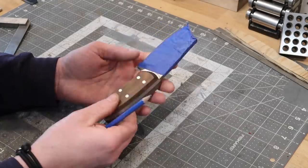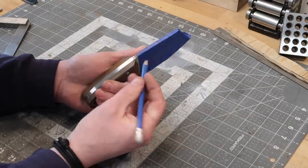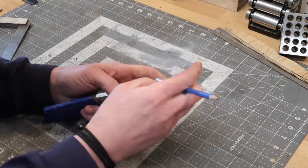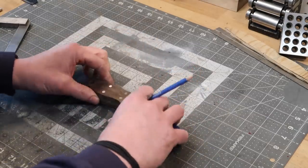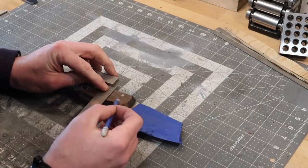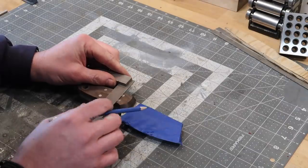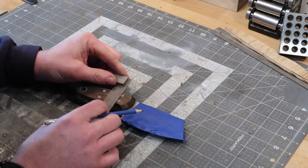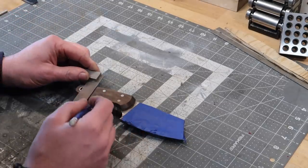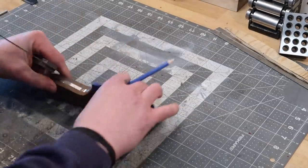These are going to be some basic lines that I'm going to grind to. When I'm doing the cutout here for the thumb, I don't get too crazy tapering this part down, but I do want to taper the back quite a bit. I'm going to use a ruler or square, and I'm using the lines of this pin as a guide — lining up the two edges of the pin. Every knife is going to be a little different, but you can work with what you've got. We've got something nice and straight there; I'll keep these roughly parallel and then transfer those marks to the other side.